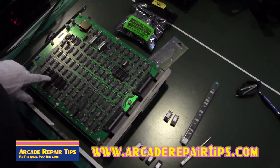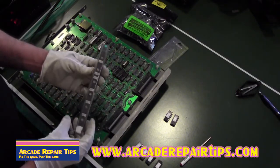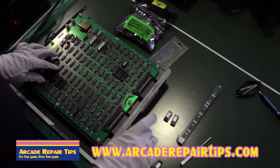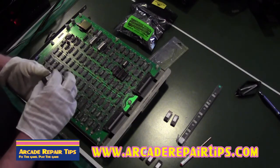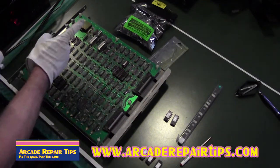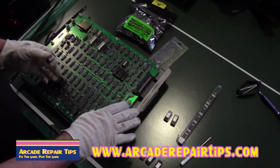We removed all the chips and we're going to keep those — Joe sent us the new chips in these holders. We'll put the old ones in the same holder. You may need them later or you could sell those — somebody may need them to fix their Donkey Kong. Now we're going to replace the new chips, and thanks to Joe, he labeled all of these really nicely. This is 7C. Remember, the notch right here at the top needs to go upwards facing that way. Most of the time on the board it'll be labeled too, but this one is not, so this would have been another good time for new guys to have taken a picture to see which way it goes.